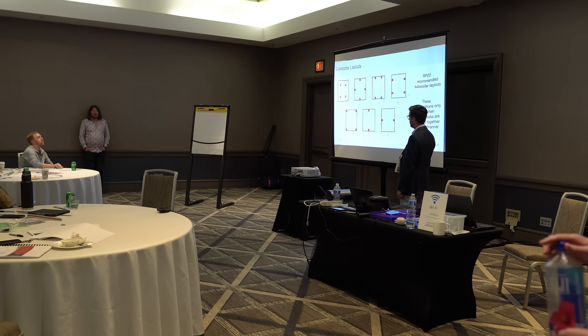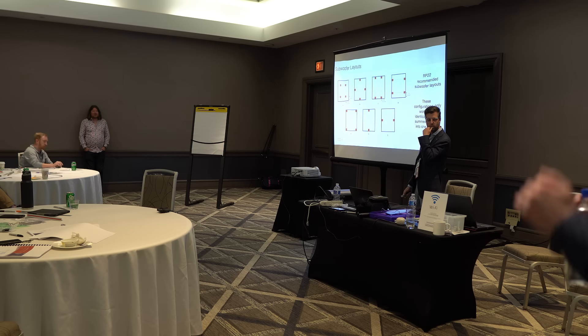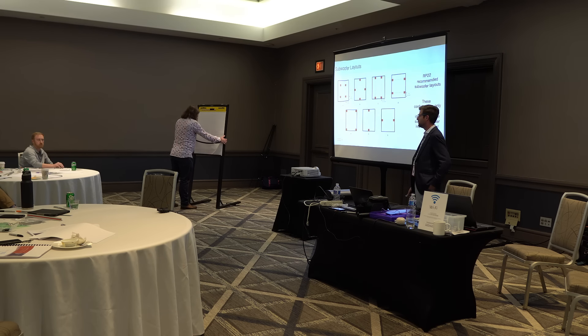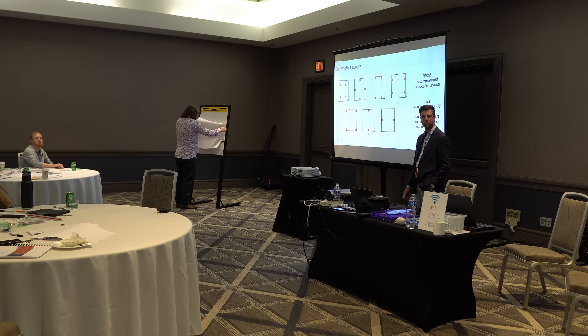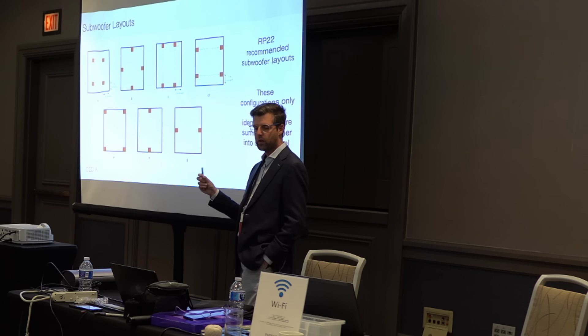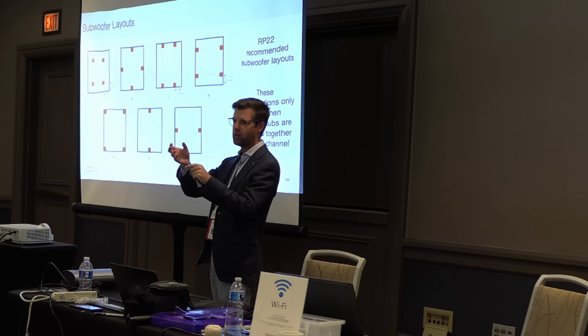I've noticed on some calibrations where I'm looking at different responses between different seats — I see a 3 dB difference here, a 5 dB difference there. But it's not high-Q, it's fairly shallow-looking. And then I go listen to some content in those different seats, and they're different for sure, but none of them are horrible — they're all a good experience. The resonance you get from modes is a minimum-phase problem. It's kind of like you took a parametric EQ, matched the frequency of the mode, and turned it up.